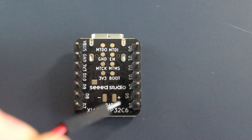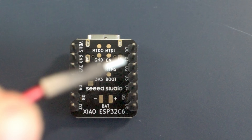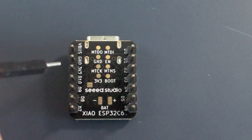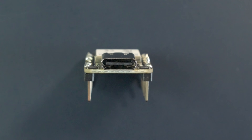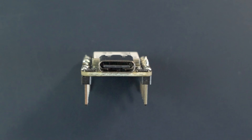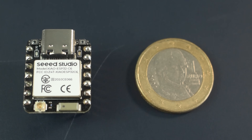You see, there are two voltages these boards are designed to use: 5 volts and 3.3 volts. Connecting a 5 volt line to a 3.3 volt pin on your ESP32 could cause irreparable damage. Having a fallback means you learn your lesson there and then, and keep building without having to wait weeks again for another delivery.